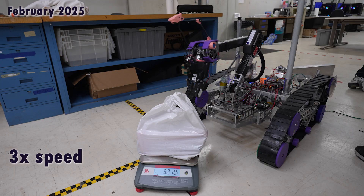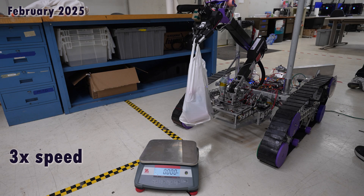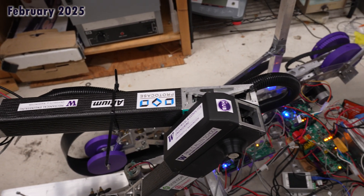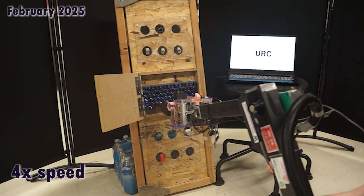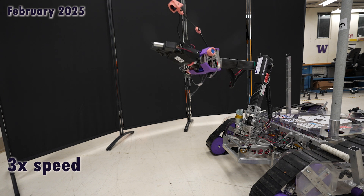The arm team is proud to present our newest design for our 6-degree of freedom arm, capable of lifting 10 kilograms within a 1-meter range, constructed with a carbon fiber body and aluminum body in the side-by-side joint configuration. This arm incorporates precisely machined worm gears at critical joints to prevent back-drivability, addressing long-standing issues where joint motors need constant power to maintain a fixed position.